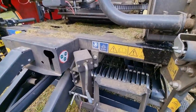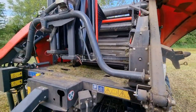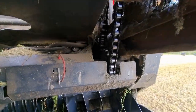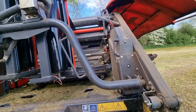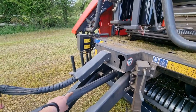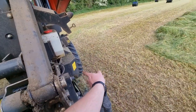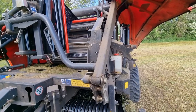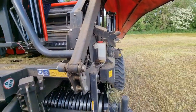I've had a nightmare — the shear bolt's gone. There's a shear bolt that runs the top set of rollers. I had a big lump suck in and it's snapped the shear bolt. The shear bolts are in here under this cover, so I'll get that opened up and I'm going to have to try and line them back up. Because the chamber is full there's a lot of tension on the rollers, so whether I'll be able to spin it or not I don't know. There's a handle I can put in and spin it by hand, but because the chamber is full I might have to let this one out and roll it out by hand to make another bale.